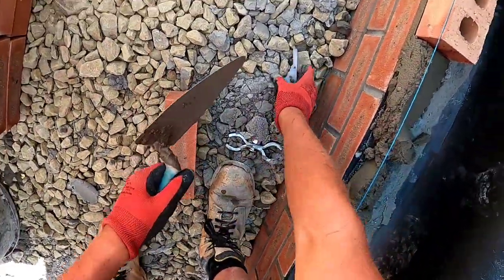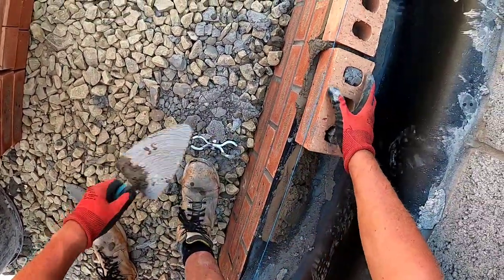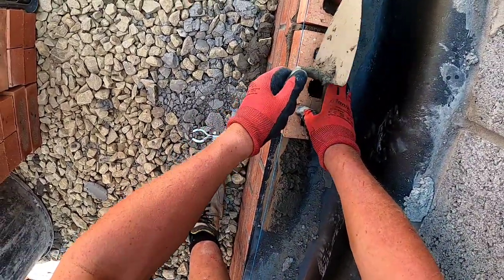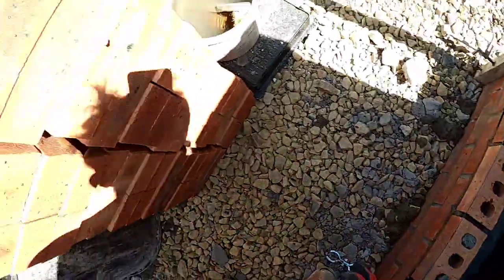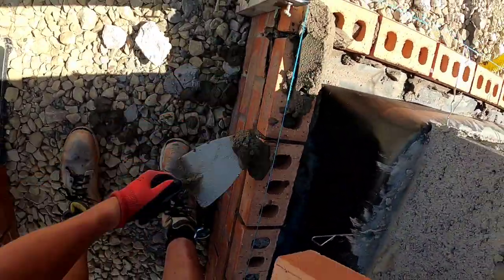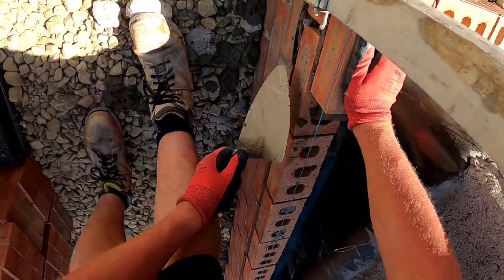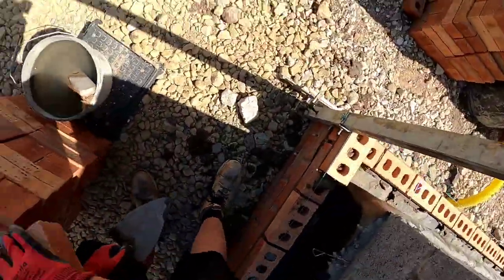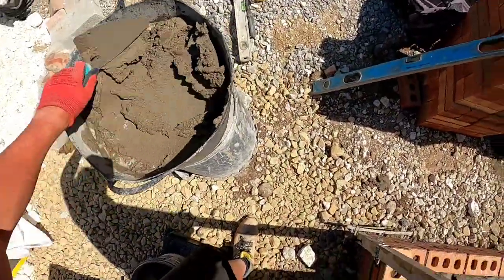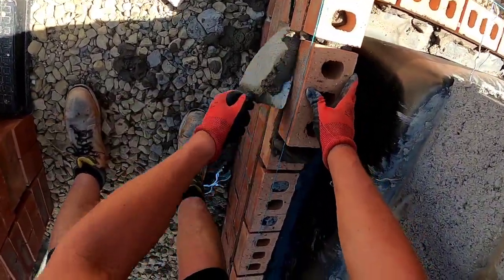But the whole idea of pick and dip is that you are filling your joint about 80% full, and you're not putting any grooves in your spread. The spread that you put over the top and press into the brick fills all those holes, all those voids, to make a solid bond and a solid, full bed and perp joint combination. A lot of people say pick and dip gives you empty joints — but that isn't the case because you're not putting furrows in your mortar, and you're squeezing all that mortar out to the front of your brick.